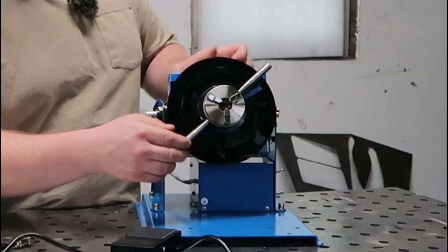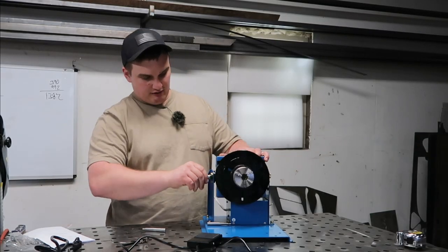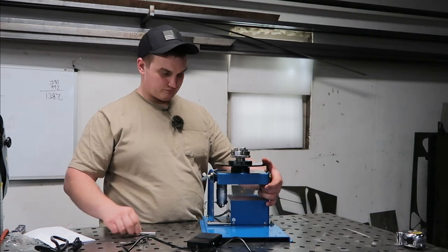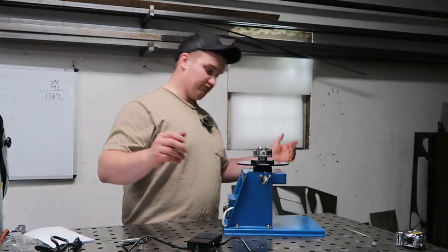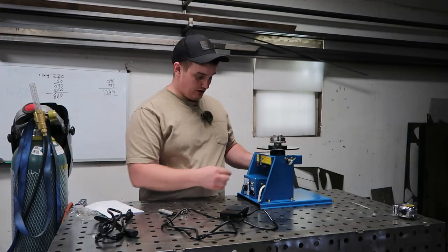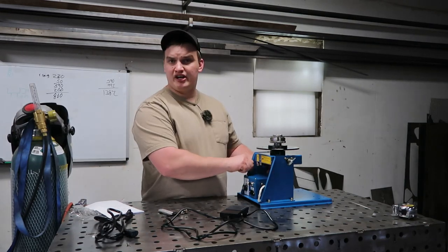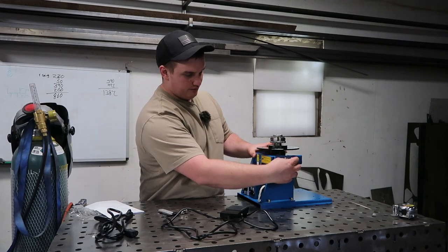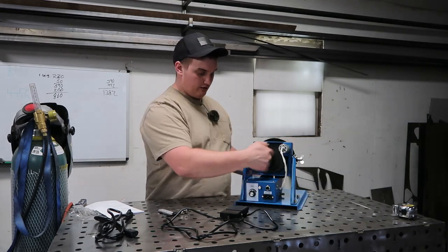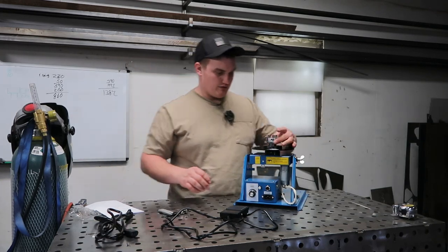Don't know if you can see that opening up or not. And this guy rotates 90 degrees, can lock at 90 or anywhere in between. But I'm dropping stuff. But as far as construction of it, first impression, it's actually pretty solid. It's all bent or press broke, probably, I'm gonna guess, 11 gauge mild steel. It's all powder coated. It's got a little 24 volt motor here with a big gear, so we get a good gear reduction there. But I'm kind of curious about this chuck here.